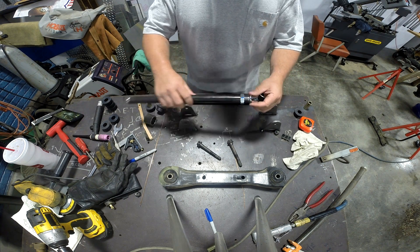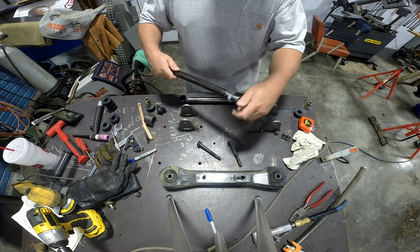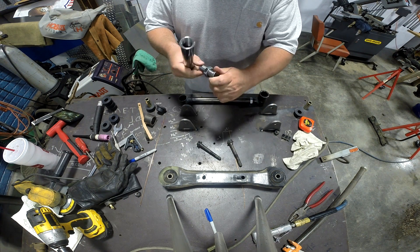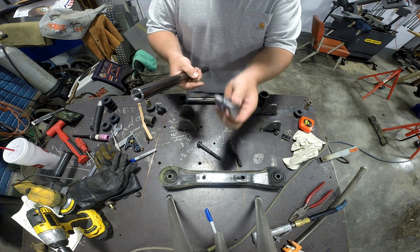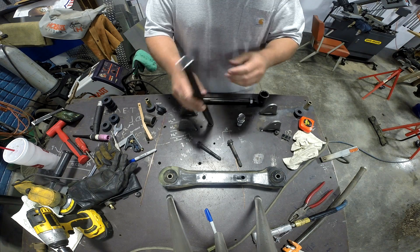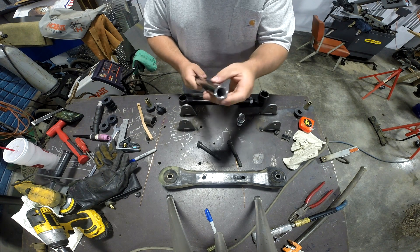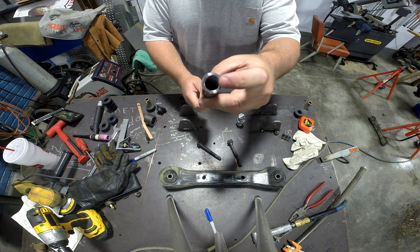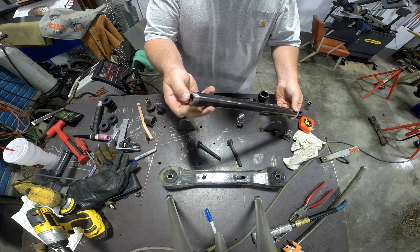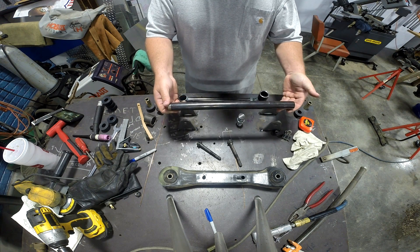In between, there's a threaded stem. If you wanted, I think you could make these out of a three-quarter inch bolt — add a jam nut, turn the head on a lathe, cope the end out — and you could fabricate these yourself if you'd care to. The tube is one inch OD and I believe also 188 thousandths wall thickness. He direct-threads one end for the three-quarter sixteen thread, sells these in different lengths, and copes one end for you. If you were putting in new front mounts you could fabricate these to the length you buy from Paul Horton.